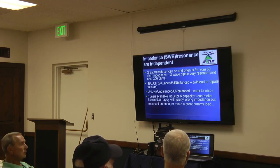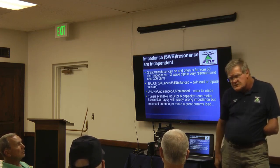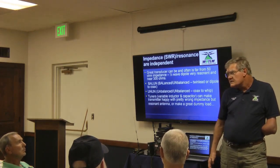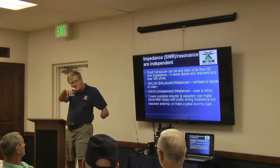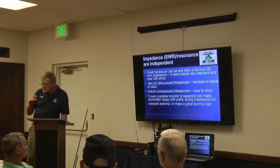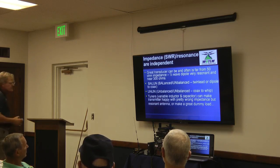I'll talk more about this as a stealth antenna in a few minutes. But it's very effective. I've worked Japan and Europe on that. Not recently because of the solar cycle we're in. But it's a very effective antenna. And I think, again, on eBay, I think I paid $103 for that, which isn't bad. But again, it has an unbalanced matching network built into that box on the bottom. And just about any HF antenna you use, you're going to need a balun or an unun.